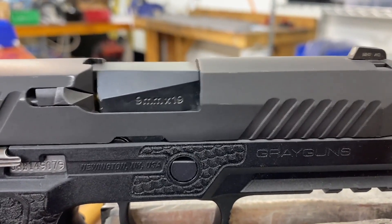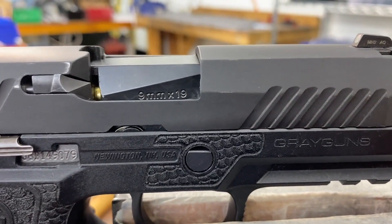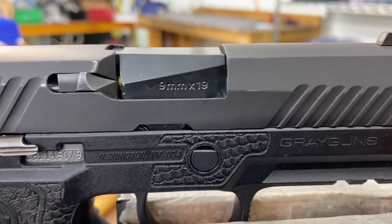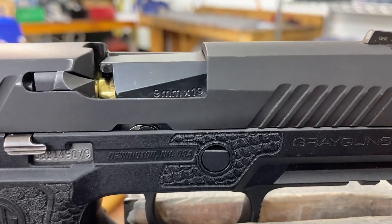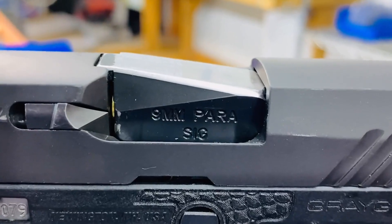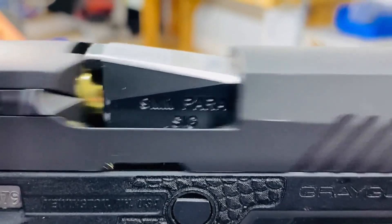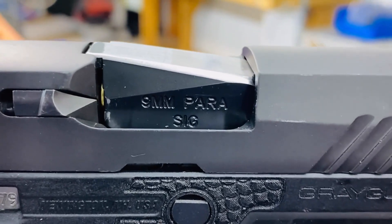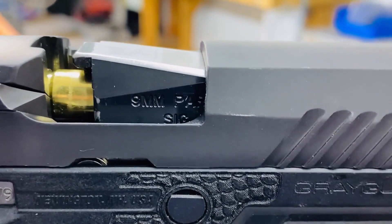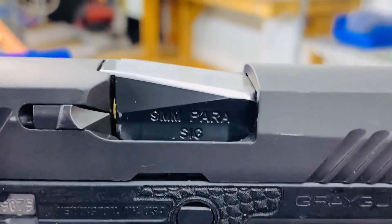Notice in the case of the stock barrel in our test pistol here, the barrel travels with the slide for about 225 thousandths of an inch before it then starts to drop, such that it can actually pull the expanded cartridge case out of the chamber. On the other hand, notice that this barrel doesn't have a locking shoulder at all. That means that as soon as the slide starts to travel to the rear, it's pulling the case out of the chamber. There's nothing actually keeping the barrel and the slide together at all. And that's what we mean by straight blowback.